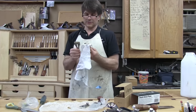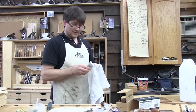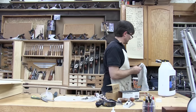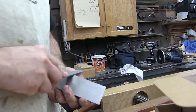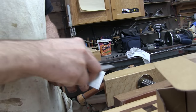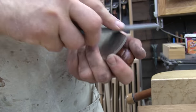Now the blade isn't stainless, so you want to make sure that it's good and dry before you put it back together. I've had several of my planes get rust because I allowed a bit of moisture to remain — you put it back together and then you've got moisture trapped between two pieces of metal. These edges are really sharp, so just to make it a little bit easier on the hand, I'm going to go in here and just break that. I'm filing away from the sole. I'm going to give it more of a radius, so I'll start here and then change the angle, and then change the angle a third time.